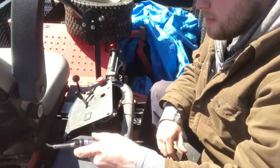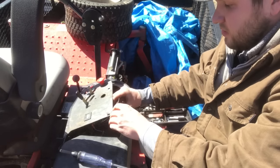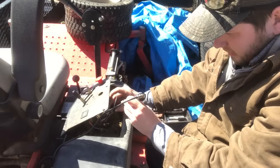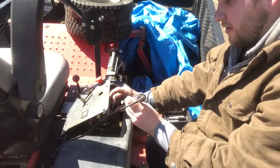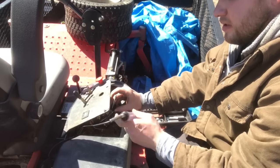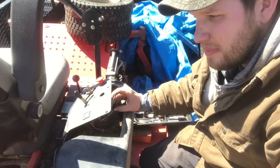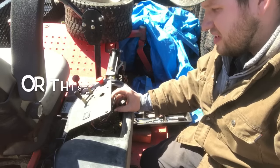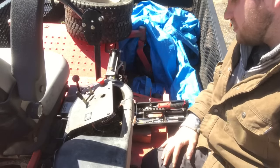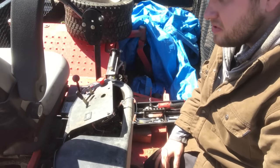I'm hooked up to power now. I just got to sit in the seat, and since this circuit's complete the engine is able to get fuel. I'll just touch the starter and it'll fire up. Somebody obviously disabled — or there's a malfunctioning — safety switch on the seat. This is just a shut-off that's probably connected into the ground circuits as well, but even easier. Two circuits: make sure you're getting fuel.